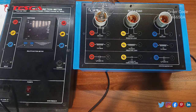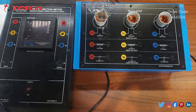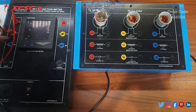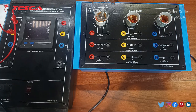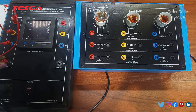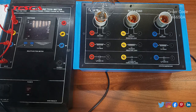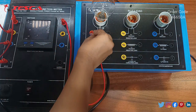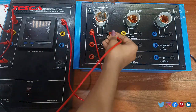So now we will move on with the connections. We have used three phase power supply here. We will give this multifunction meter three phase power supply R, Y, B as connected and then the neutral terminal. Now we will connect the other terminal of the multifunction meter to the resistive load and then the neutral.